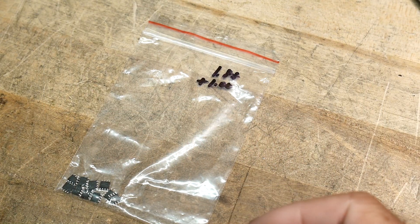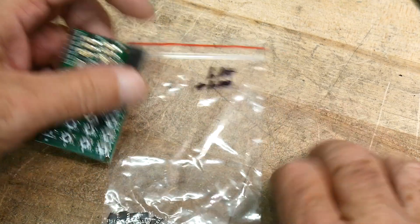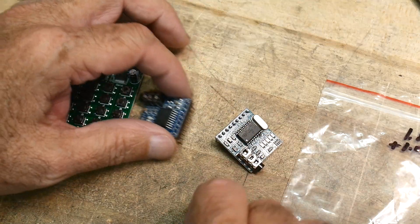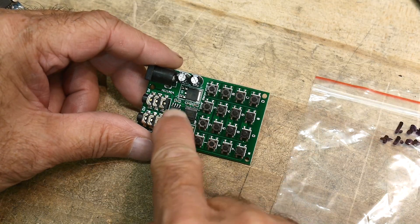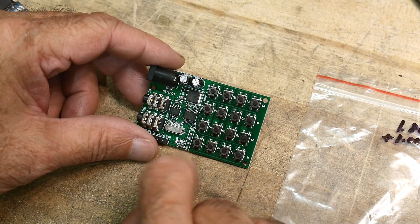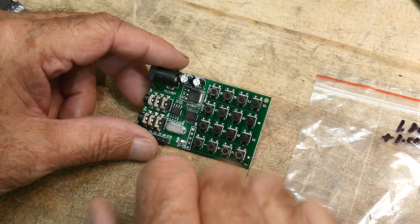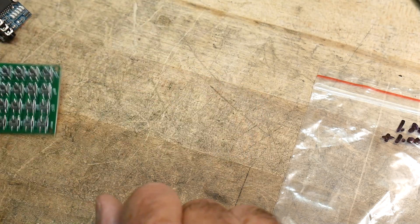During my previous videos on DTMF stuff, I had these DTMF transmitters and DTMF receivers — encoders, decoders, whatever you want to call them. I was very impressed with a particular IC: this little 8-pin guy. It's a serial input DTMF generator. All you need is the chip and a crystal, and you're ready to go. You can just talk to it serially and it outputs DTMF tones — I thought that was just the coolest thing ever. So I looked around to see if I could buy those chips, and you can.